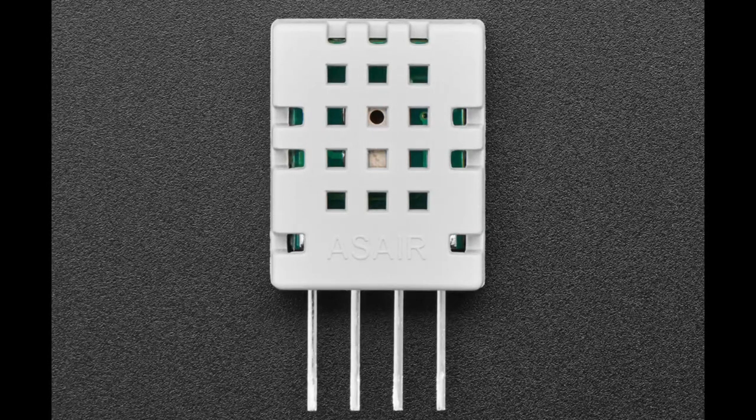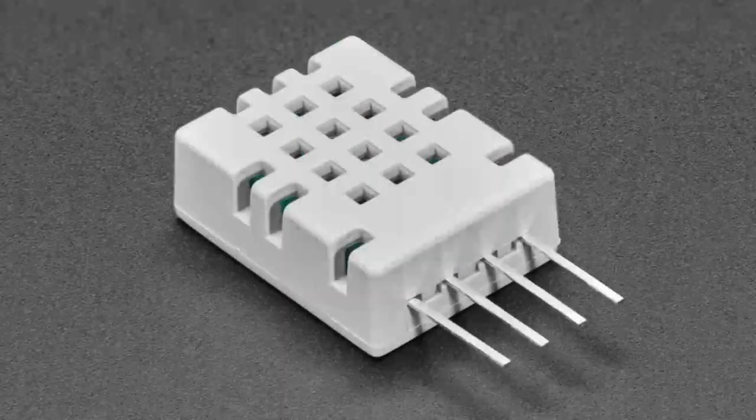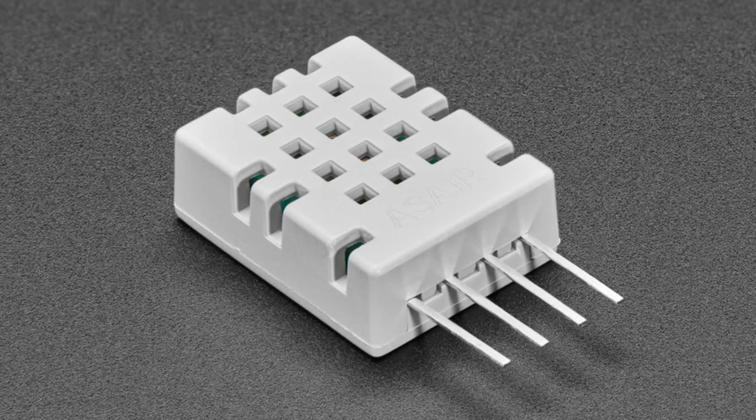One thing I will note about this sensor is it needs to run at under 30 kilohertz clock for I2C, which is unusual because the default I2C clock for many boards is 100 or 400 kilohertz. So you have to tune your I2C controller to run. I use, you know, 20 kilohertz, for example. Some controller chips like the RP2040 and ESP32 were happy to do this. I told them, hey, please run at 20 kilohertz. And they're like, sounds great.